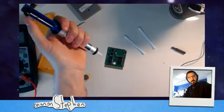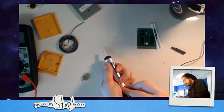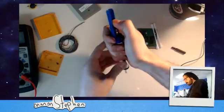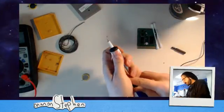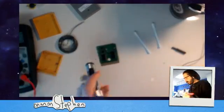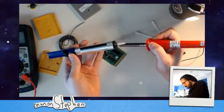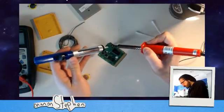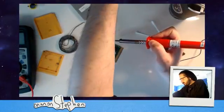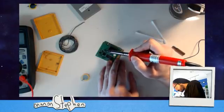Oh, this thing gets clogged so often. There's this other stuff you can buy, called desoldering braid or solder braid. If you just go in and say I want some sort of braid to get solder off at the electronics store, they'll know what you're talking about. Oh, there we go. Ew. But with that stuff you press the braid on the solder, then you heat it up, and it absorbs into the braid. Comes off real nice. This doesn't leave the cleanest surface, but if you just reflow the solder over it by heating it up a bit, it should clean it up real nice.